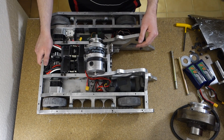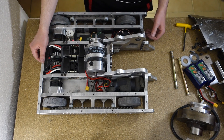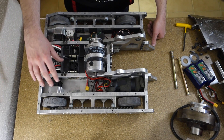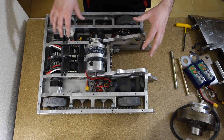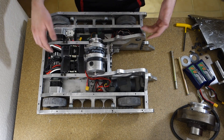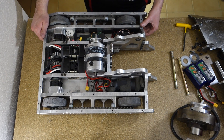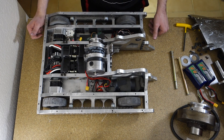You can see the frame — it's all half-inch aluminum, water-jet cut. Pretty much everything except the two main rails is 6061. Those rails have actually been the same parts since 2007, so they've never needed to be replaced. I've done a little repair work trying to straighten them out after hits, but nothing too serious.